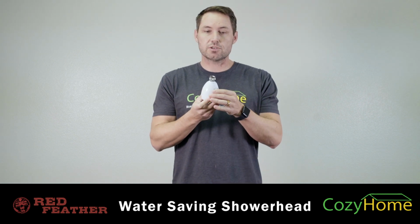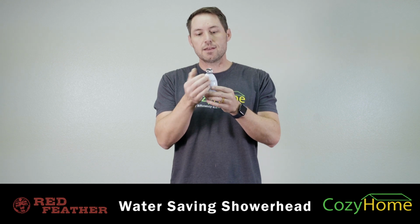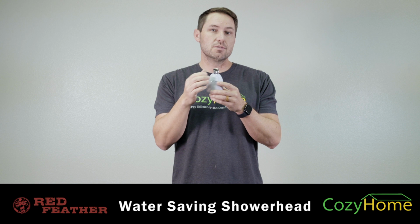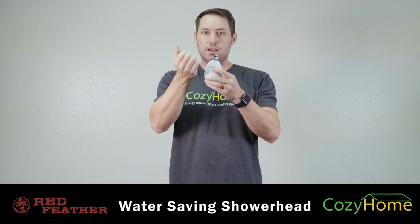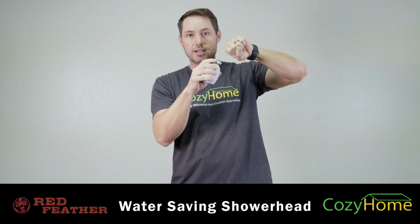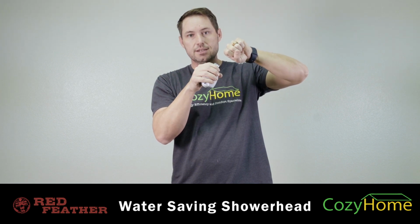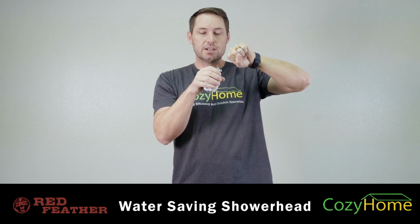So these are pretty straightforward to install. You just need to unscrew your old shower head. And in order to do that, sometimes those are stuck on there pretty good and you might need to use a pliers to grab around the neck of the shower head to get the old one off. And I do recommend grabbing the actual shower neck to brace it when you're trying to take the old one off, so you're not just leveraging against that shower neck, because that sometimes can break off and that's a big deal if that breaks off.